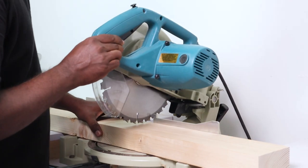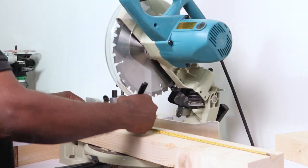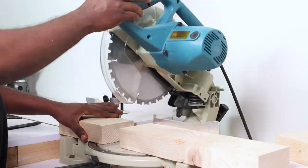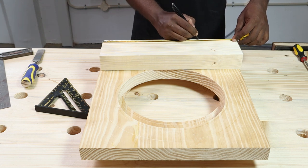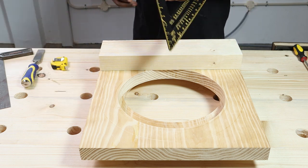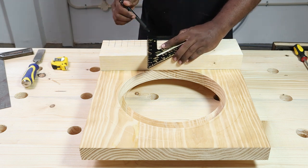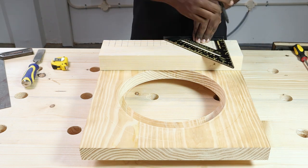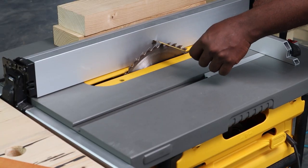Now it's time to make the support piece for each leg. For this, we took a 2x4 lumber — we need two such pieces of 14 and a quarter inch length for the support pieces. We had to make a box joint on the support piece for inserting the slat pieces into the slots in the box joint. Here we are marking the lines for making the box joint. We needed to cut out every alternate segment in this piece, marking uniform lines with an equal spacing of 3 quarter inch. You can check out the plan for this project on our blog Mellow Pine by clicking on the link below this video. After we marked the slots, we made the cuts using the table saw for both the support piece and the legs.